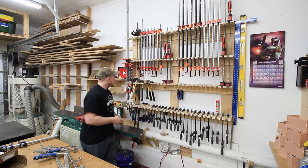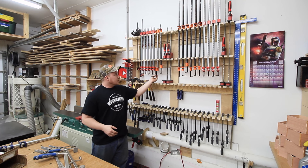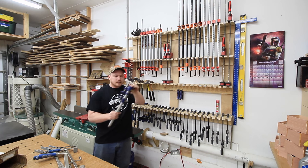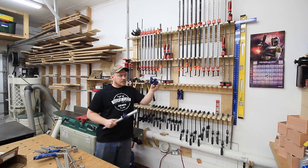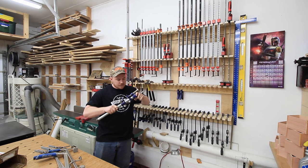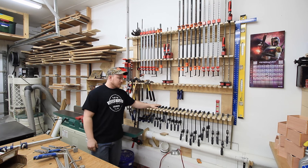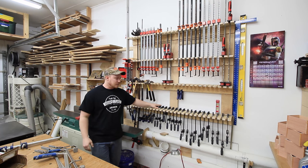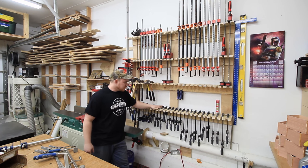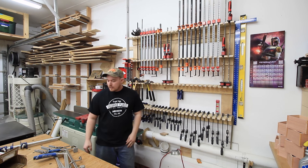So to summarize: my favorite clamps are half-inch pipe clamps with a handle that swivels. The pipe clamp head screws onto the pipe — I don't like the ones with a quick release on both sides of the clamp because I've found those slip. I used to recommend Harbor Freight F-style clamps, but they're just so frustrating now that I probably wouldn't recommend them for someone doing woodworking long-term. Hopefully that helps give you a little insight on what I think about my clamps.